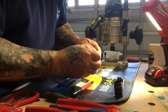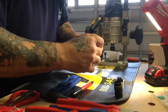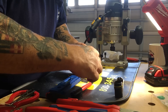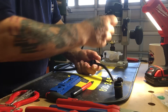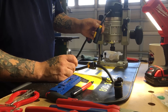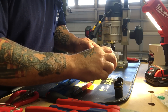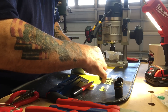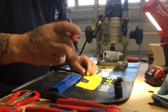Put your finger inside this — it's a 14 AWG two-conductor cord. Push the back piece on and get it up a distance so you can work on it. On the female end you don't have a lot of room since you'll cut about four to six inches — enough that it fits nicely inside the toolbox. Then take the white piece and put that on with the angled end heading into the locking piece.